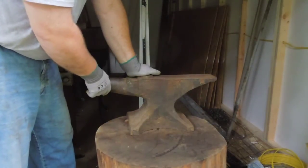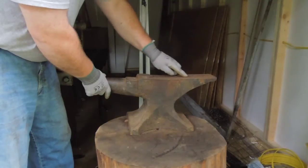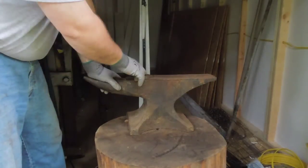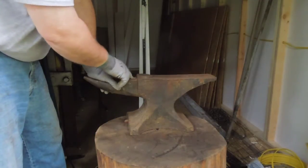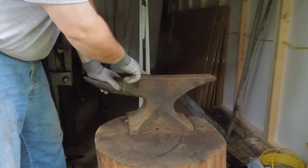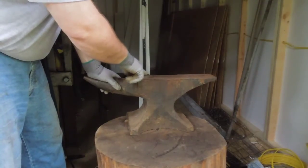The top of the anvil is worn down, which makes me believe it had a hardened plate welded to the top of it. Around the hardy hole it has been beaten in, and the pritchel hole is rounded over too. At some point someone welded a pad on the front of the anvil — I don't know what kind of steel it is, but it's harder than the hubs of Hades. The grinder won't touch it. I managed to sand off a little bit of the top by going through a couple of wheels, just enough to get a flat spot up there.